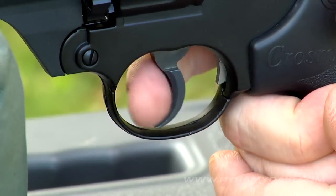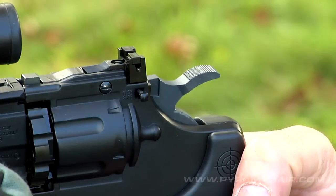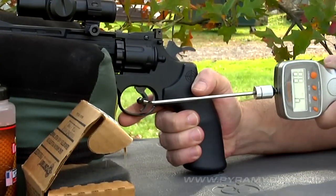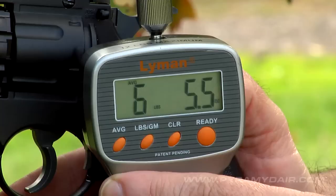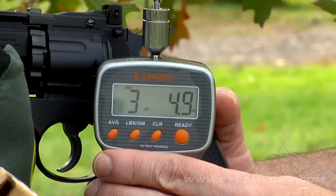The mechanics of the metal trigger and hammer is outstanding for the gun's price range and the action indexes with flawless precision. The double action pull weight is on the heavy side according to my trigger gauge, but strangely it doesn't feel like 6 pounds 5 ounces, most likely because you're just having too much fun shooting the Vigilante. The single action pull weight in my test was 3 pounds 5 ounces.